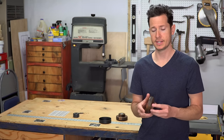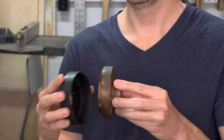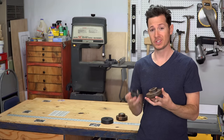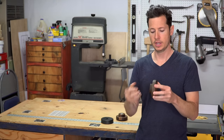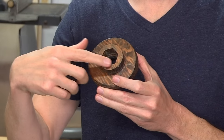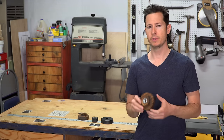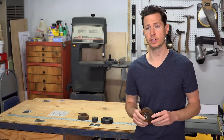The first time around when I built this vise, I made the hand wheels by using a large hole saw to cut out this shape, and then by using a small hole saw to cut out this shape. Then I removed the waste material and drilled my cavity for the hex nut. This time around though, I actually used a lathe to make the hand wheels. I had been looking for a good excuse to build a lathe for some time, and this project gave me that perfect opportunity.